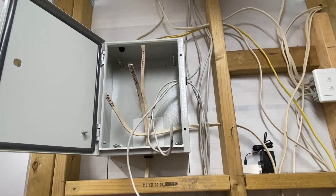Hello and welcome back. Today's project is a little bit different. I'm going to be working in this electrical box here in the new shed. This electrical box will hold the isolating switches for the compressor and the dust extractor. It also terminates network cables coming from the house, and I'm going to add a low voltage mechanism for starting up the dust extractor, so that allows the dust extractor to be started from any of the blast gates.